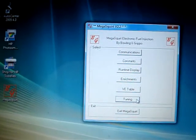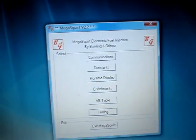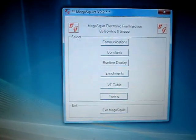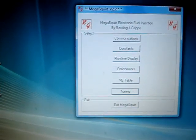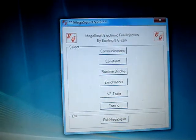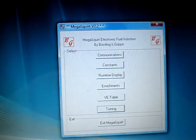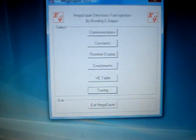I'll keep doing videos — I've got a bunch of different cells I'm trying. I've got a dry cell like EBN, and this cell you just saw is very similar to Zero Fossil Fuel. I am using his PWM, and it seems to be a fairly stout unit. I've been burning out MOSFETs but I think I've got that handled — I'm going to get a bigger MOSFET that can dissipate the heat better. His latest video mentions adding a capacitor as well.